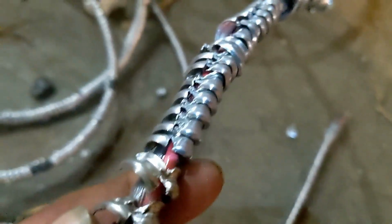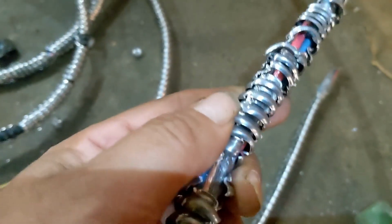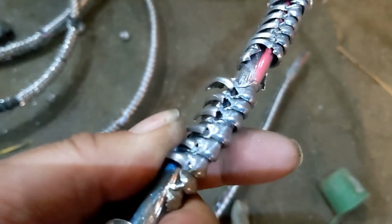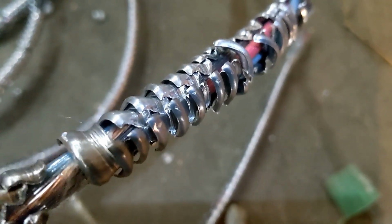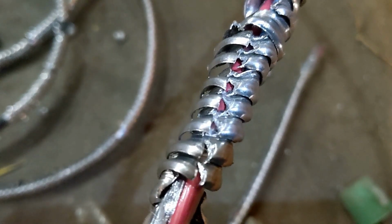But if you see yourself turning into, I'll show you over here, just smashed up goodness that isn't cut through all the way. Like one side's just not cut through. Your guides are too far apart. So this is just a hair smaller than what I got my guide set up for, and it serpentines in there and it doesn't cut right. So you really got to sort your size and adjust your guides dead on, or you'll get that product right there, which is a pain in the butt.